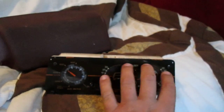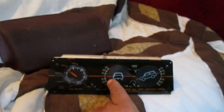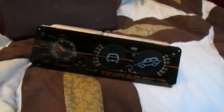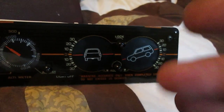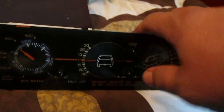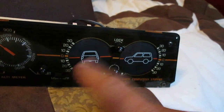Once you've got that off, you'll see there's just a couple of hollows in here — one larger one here and one here — individual for the altimeter. These are just basically little tiny thin plastic dials that have the picture painted on there and float on the end of a shaft. You just basically slide that little faceplate on; you can pull it right off actually, but it's kind of snug and I didn't want to crack anything. So basically you take these screws out, pop this face off, and then on the back, pull the light and pull these three screws, and that piece with the two gyros in it will just fall right out.